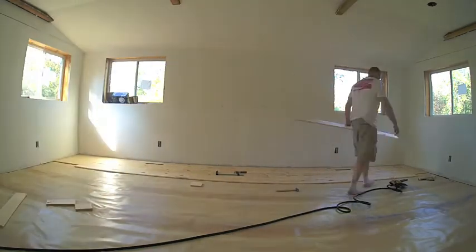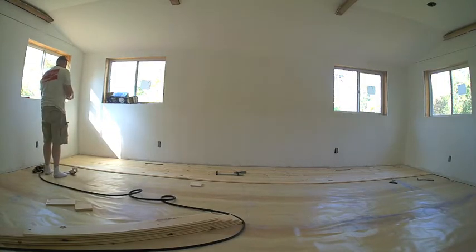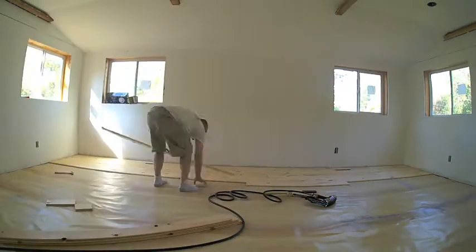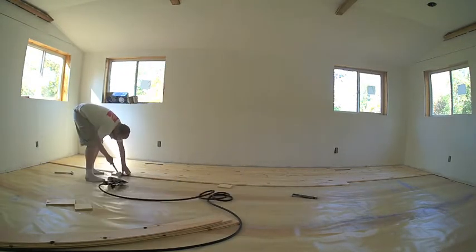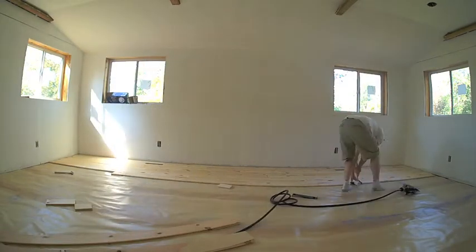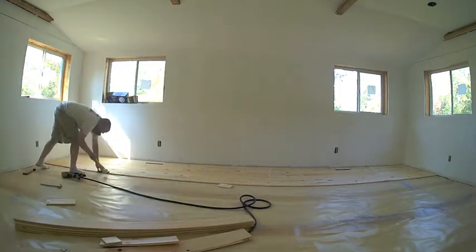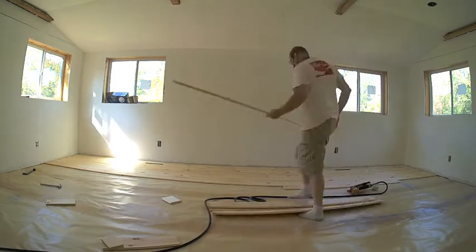We chose a New England Knotty Pine. We really like the character of it. Now the boards came with a V-groove in it. We chose to use the reverse side because we just wanted it flat, but it was nice tongue and groove boards. I just staggered the joints. It nailed down real easy, went together easily. There are some various knot holes, some imperfections that I'll have to deal with before I put a finish on. But the look of it, we really enjoy, we really like it. We are just gonna put a natural finish on it.